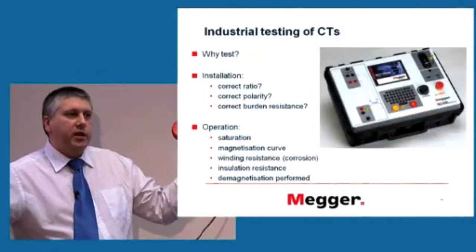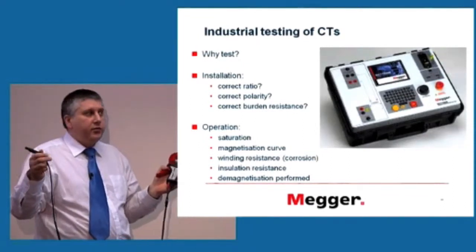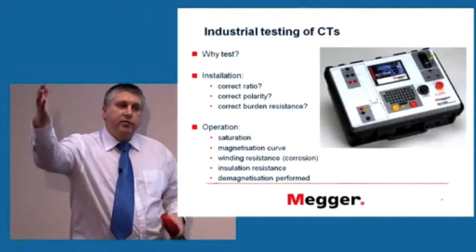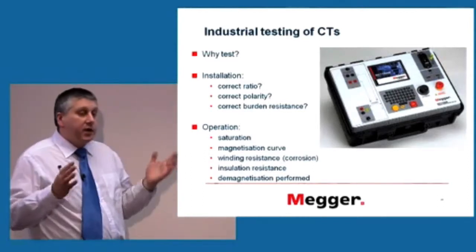I mean, that wire will have a few tens of milliohms. That has to be taken into account. And if we have high voltage, high power applications, the wires can run for meters. So there can be a substantial resistance in those wires, and this has to be taken into account.